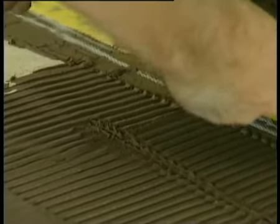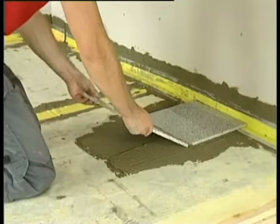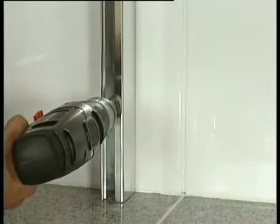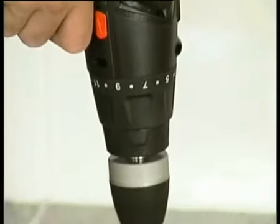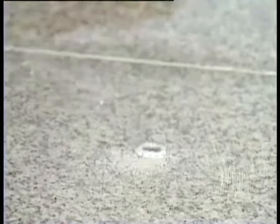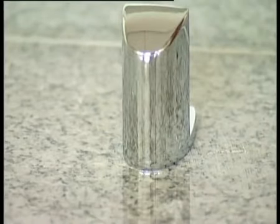You are now ready to tile your wet room. You will find smaller tiles and mosaics easier to maintain the gradient of the Wickes deck. You now have a beautiful wet room that can either be fitted with a screen, enclosure, or left as an open shower area. When installing the Wickes deflector panel, ensure the wet room installation has had 12 hours to set before drilling the floor support to the tiles. Remember, never drill through the tile and waterproof fleece as this will compromise the wet room floor. Only drill 4mm deep into the tile to locate the deflector panel base plate.